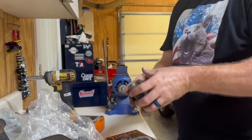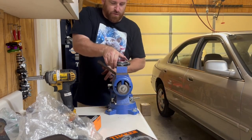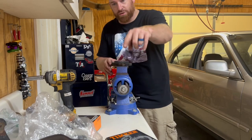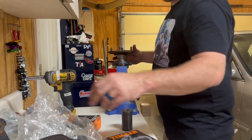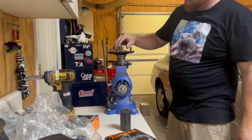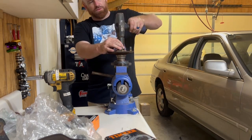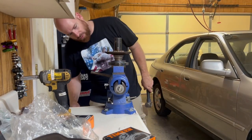Now we'll take a look at these bearings. Yep, it's a bearing. I'm going to put it in my vice — not going to get crazy with the pressure on it, I just needed to hold it there while I smack it in place. And I don't want to damage the outside of that bearing where it goes into the old spindle there. Where'd my 30 millimeter socket go? I'm not just going to go all crazy with the hammer — I'm just going to tap it a little bit to get it started. Last thing you want to do is gall up the edges of that. Take my socket and just drive her home.